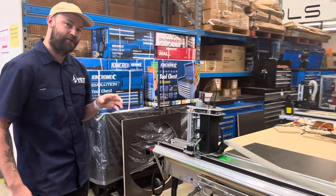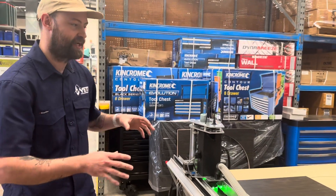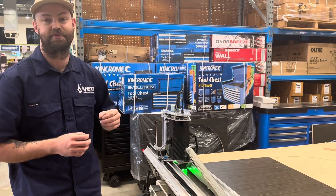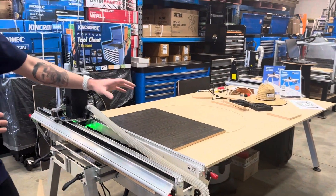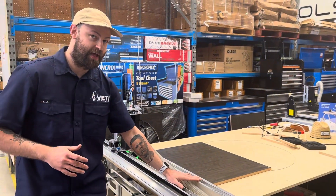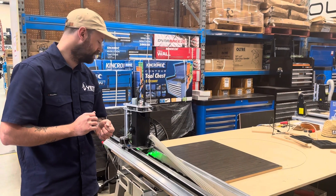What makes this machine quite unique is that we have a relatively small form factor machine but we can actually process a full sheet of material. We have a cutting area of 1250 by 2500, and we have an adjustable upper X axis that can fit 150mm worth of material in the machine.